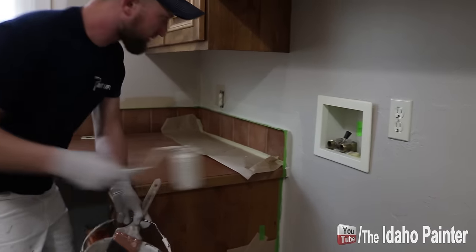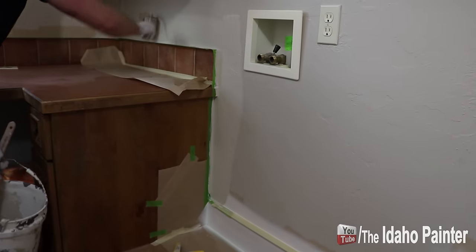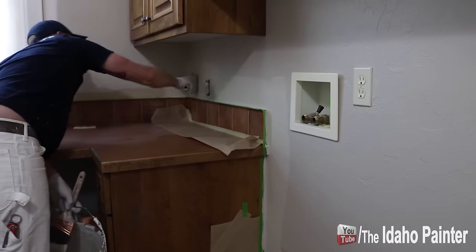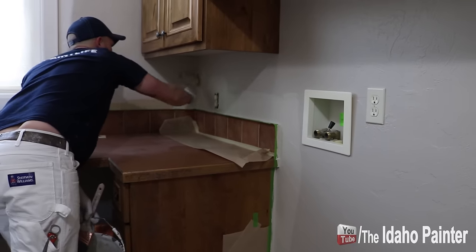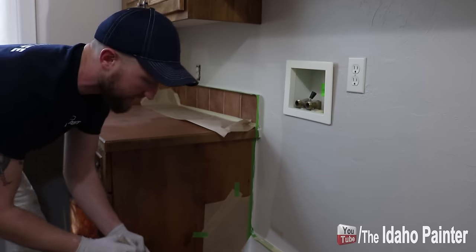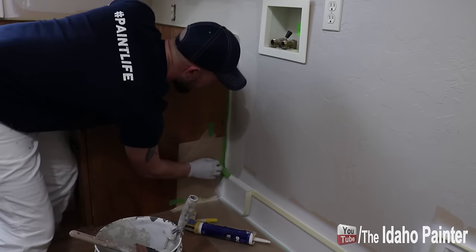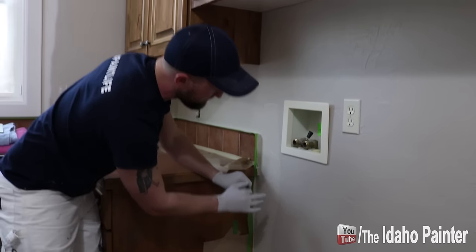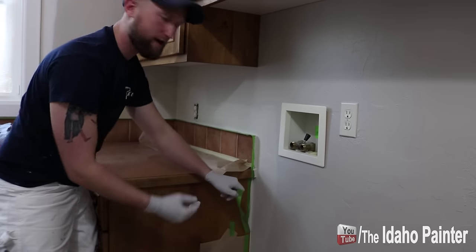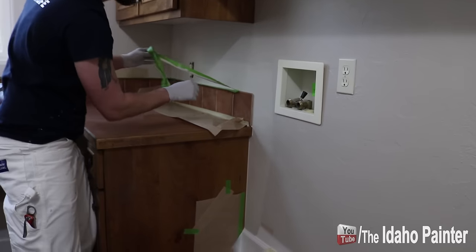We cover over the stippling with our orange roller. You don't want that roller to hit the edge of the tape where it's gonna dig that caulking in. We'll pull off slowly — as Chris said, you want to go slowly, and always pull towards where you're going instead of away. That also helps keep paint and caulking from flipping back, and you're left with a nice crisp straight line.